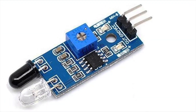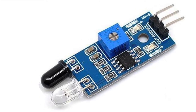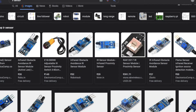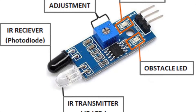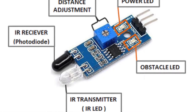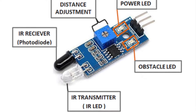This is an IR module with receiver, generally used with the LM393 comparator. When you search online for an IR sensor, you will mostly find these sensors in the search results. This IR sensor works well and consumes very low voltage, but it is only suitable for indoor usage and only where sunlight is not present.